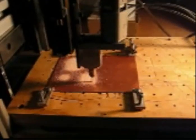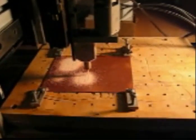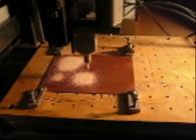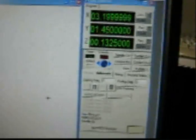It's cutting a series of squares here where various circuits will be soldered onto the board, and I've laid it out so that there is a circuit flow with the various parts. Any area that's not cut is used as the ground plane for the circuits. We can watch the cutting patterns and see all the actions for the various axes — the Z axis, X axis, and Y axis — all under computer control.